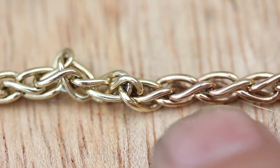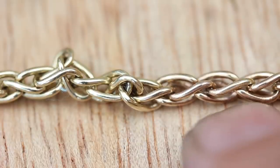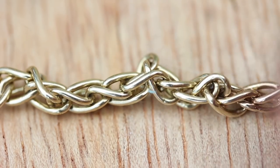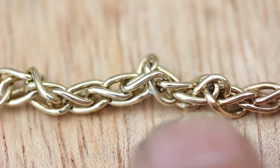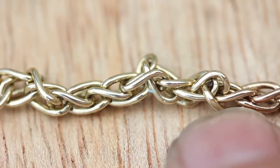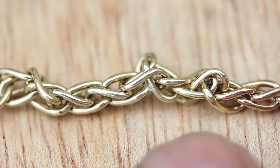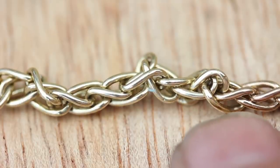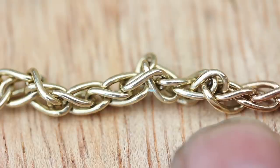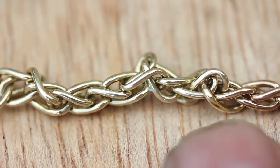You can see some links are now in the proper orientation — it's basically two curved chains interlinked. Moving along, there's a good section here, but there are a couple of knots in the middle where some links just refuse to turn round. The next stage is to physically clip them, cut them out, sort the chain out, then put them back in the correct orientation. That's the easiest way of doing it. I probably only need to do about five or six links along the length of the chain.